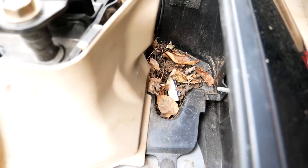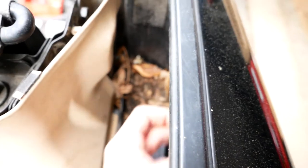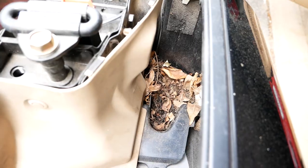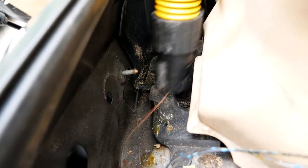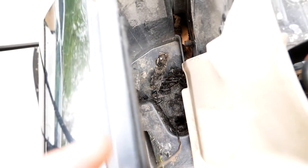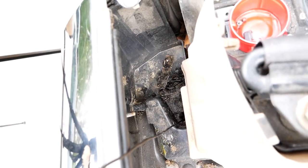Here you can see just how much junk builds up in these drains. There are tons of leaves and some paper stuff down there — this really needs to be vacuumed out. I got the leaves off and there's a built-up layer of sludge down in here. We've got to get that out because that's preventing water from flowing through. I got in here with a coat hanger and was able to pull a lot of the stuff at the surface out.